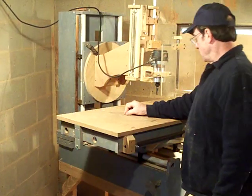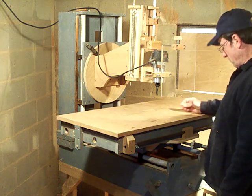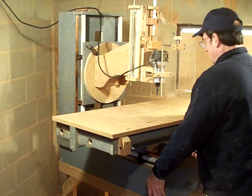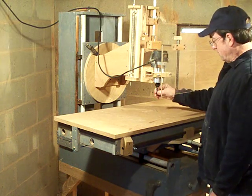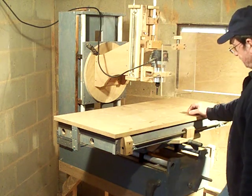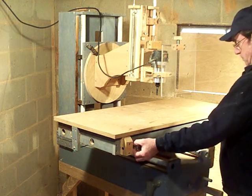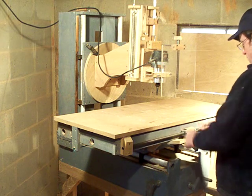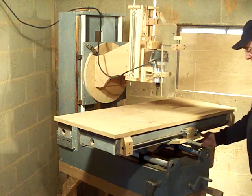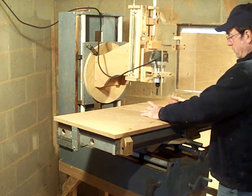Speaking of this pin, I have a few different places for it. This is a pin router now — what I do is get this pin directly over center of the bit, using the same size bit wherever the pin is. I have stop features on the table; I can actually lock the table from moving this way, and also down here, so the table can't move. This way you can do pin routing.